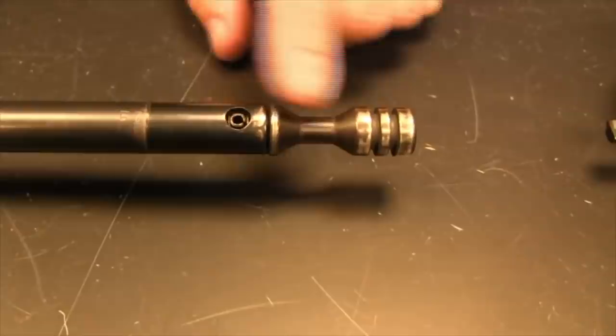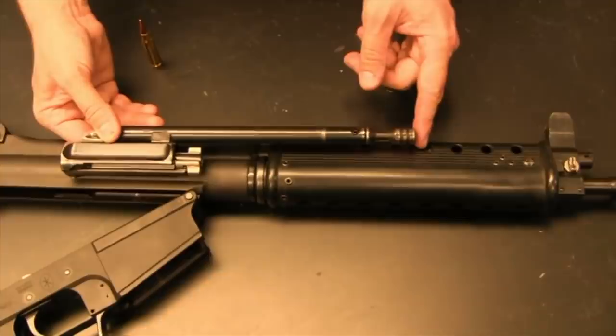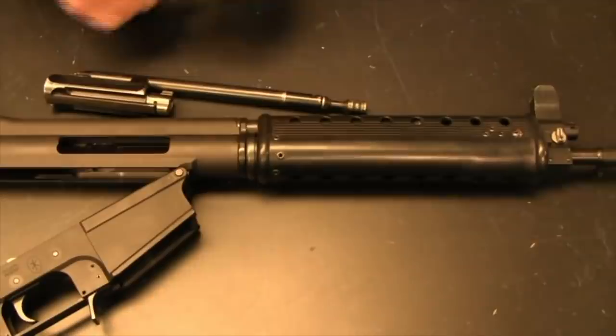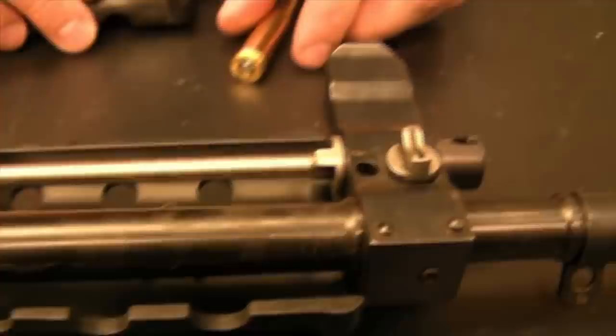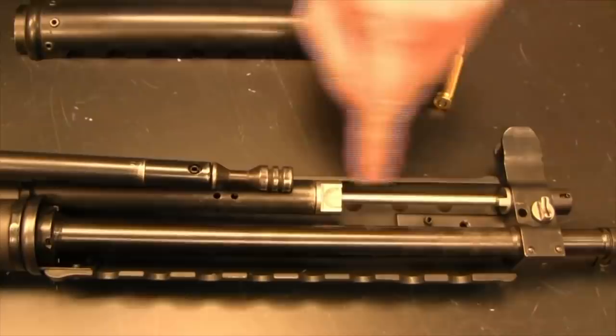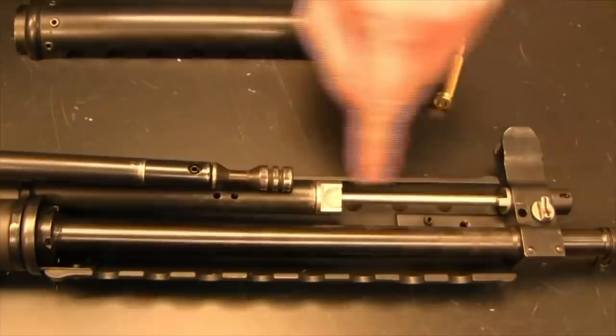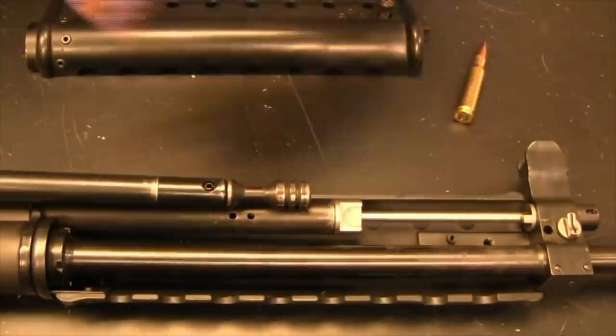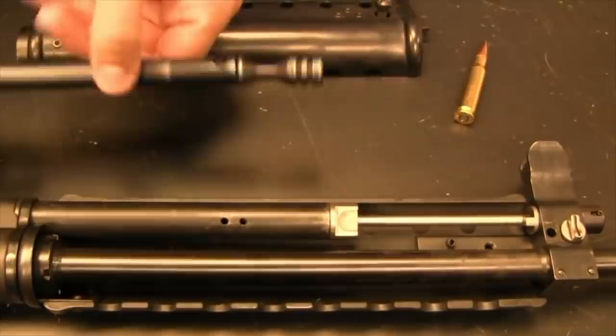Moving up front, you can see this has a very short gas piston, especially considering the length of the handguard out to the gas block — the piston only comes about halfway up the handguard. Under the handguard there is a gas tube very much like an AR-15 direct gas impingement tube, bringing gas from the port in the barrel back to the beginning of the piston. The reason for this was to reduce the mass of the piston and gas tube, eliminate a little weight from the design, and prevent extra weight up front moving back and forth and hindering accuracy. Kind of a clever design.